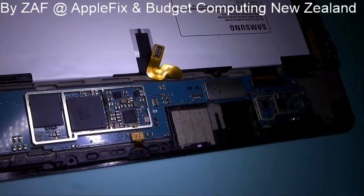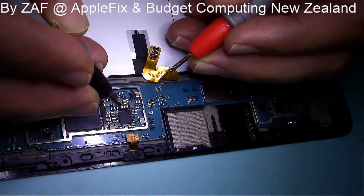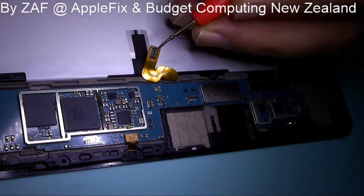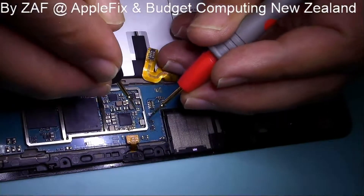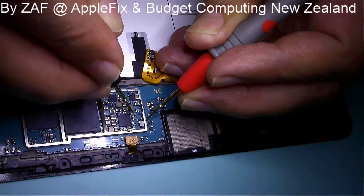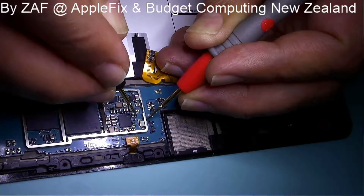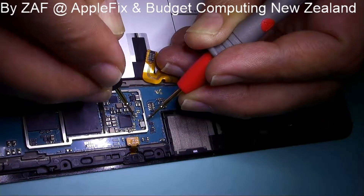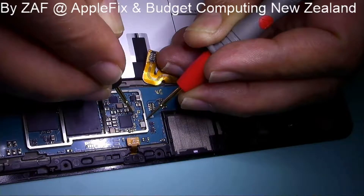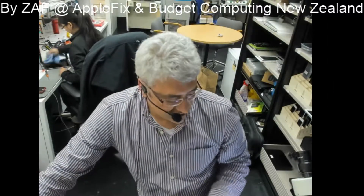We will look at the component — it was quite hard to figure out, but I think it was this capacitor here which was heating up. Let's put the multimeter in continuity mode and check. This line is short — that's the reason why. I think either one of these capacitors was showing heat, so we don't know which one it is yet.